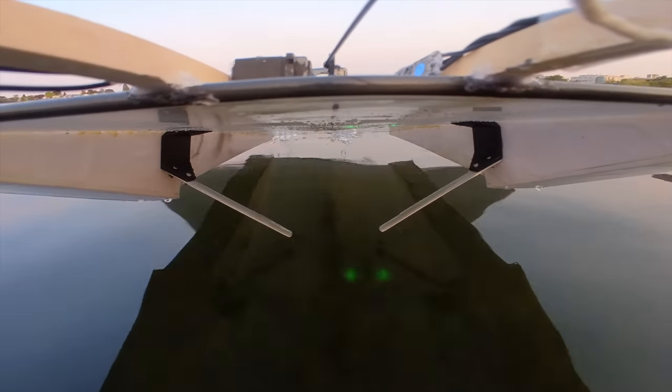There's also a big reason why to use hydrofoils on aircraft — there really isn't a better option. One of the reasons ground effect vehicles haven't become popular is that they can't really handle choppy water at all, and hydrofoils could really help make takeoffs and landings much smoother. But then the hydrofoils would need to be retracted so the aircraft can fly lower to utilize ground effect more effectively. Aerodynamics and hydrodynamics don't always scale down very well, so at RC scale the concept is really difficult to make work and kind of impractical. I strongly prefer my flying sled to have no hydrofoils — it just works so much better that way.